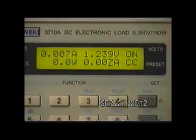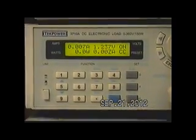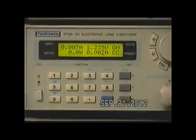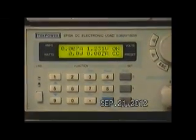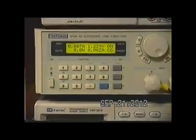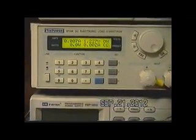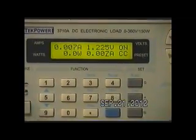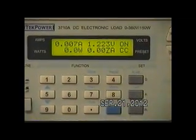I can tell you though, from experience, from watching the rate of discharge, that it did not take a full charge. In other words, the efficiency of the battery. Even though we're approaching full charge voltage, we have not put the amount of current in there that we normally would in a conditioned NiCad battery. Now, I'm sure that most of you should be familiar with the idiosyncrasies of NiCad batteries, their memory problem, and the fact that they like to be fully discharged. They like to be discharged at a high rate. Charging, if you want to extend that battery life past what they normally tell you can use, use a good old, somewhat expensive burp charger. You can get a very extensive use out of that battery if you properly take care of it.